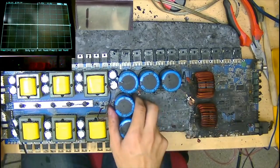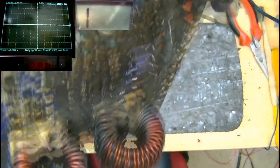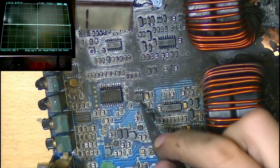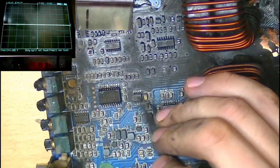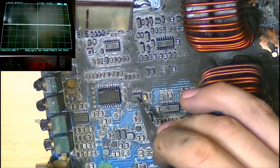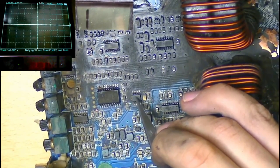Now the question is, where's the power supply MOSFET driver? That might be toasted. That is over here, this bad boy. Nice big package for once. Usually they use a tiny little SOIC package, which is a bit of a nightmare to solder. So provided that's not damaged, we will start building some power supply switching. So I think it's time for power.